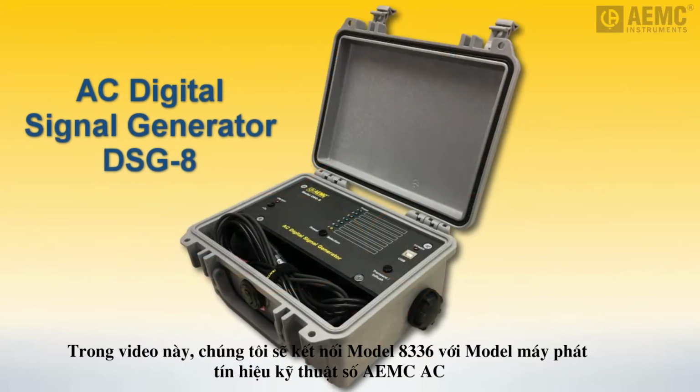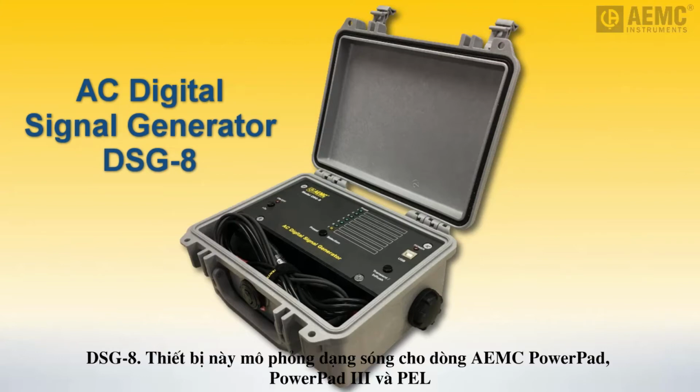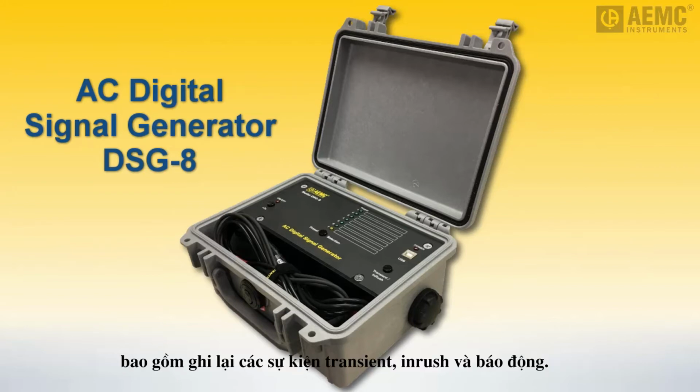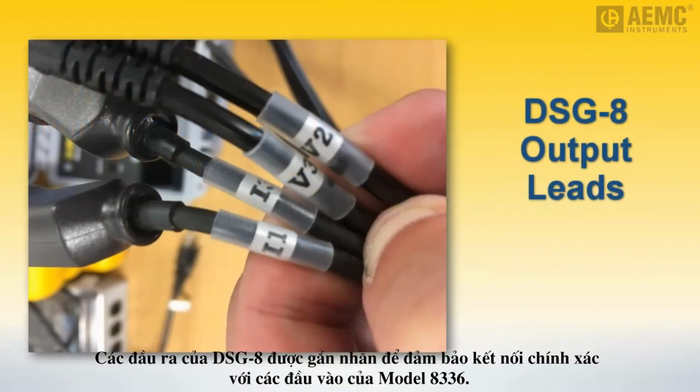In this video, we will connect the Model 8336 to the AEMC AC Digital Signal Generator Model DSG8. This device simulates waveforms for AEMC PowerPad, PowerPad 3, and PEL series instruments. The DSG8 can create simulations for any AC distribution system supported by these instruments, including capturing transients, inrush, and alarm events. The DSG8 output leads are labeled to ensure correct connection to the Model 8336 inputs.